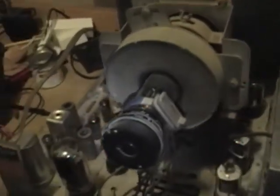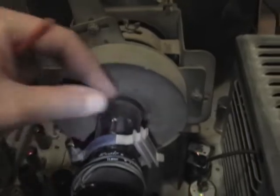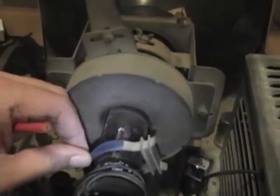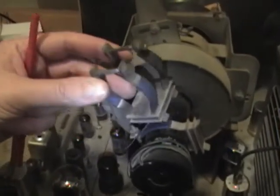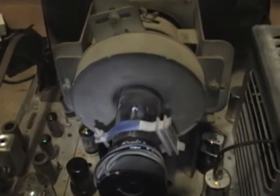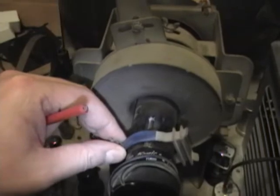And the last thing I noticed is that this ion trap has some wiggle to it. I loosened it up while I was gluing this down, but even when it's tightened down, because it is only a single pole magnet, unlike these dual pole magnet guys, there's only one point where it's actually got some friction holding it down. So no matter how tight you tighten this, it still has some wiggle.